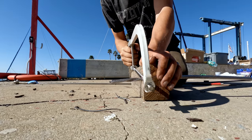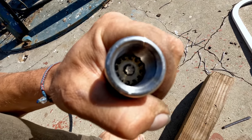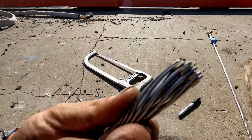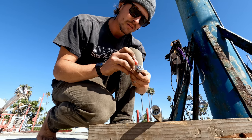I think the compression fittings are really good, very strong. The only issues I've generally seen with them has been incorrect installation, where they haven't been threaded on properly, or the strands have not been wrapped around the cone properly, and/or Loctite hasn't been used where recommended.